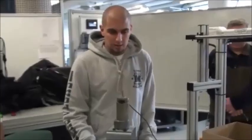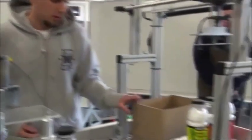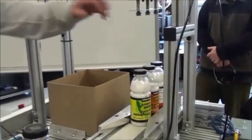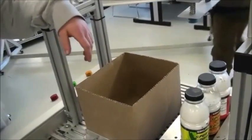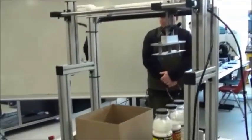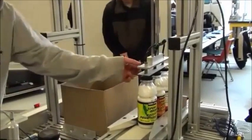I'm responsible for the pack station. Once three bottles are available at the end of the conveyor — with feedback from a sensor — the cylinder here will extend and turn on the vacuum system, picking up the bottles. It'll retract, slide over, and drop them into either a six-pack or nine-pack, then return to its home position. The piece I'm most proud of is the gripper — notice the compression as it's coming down.